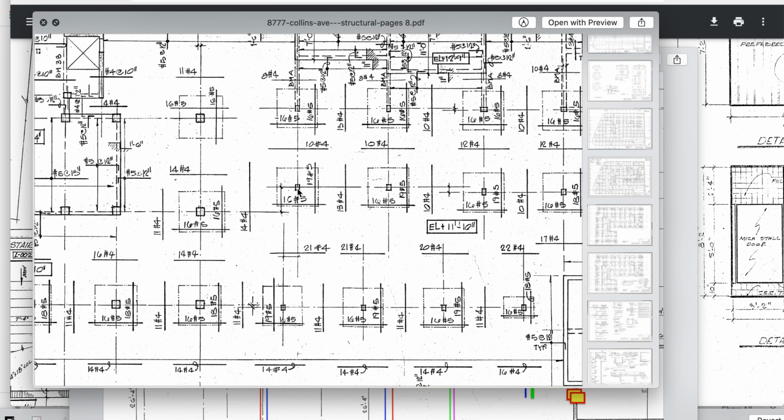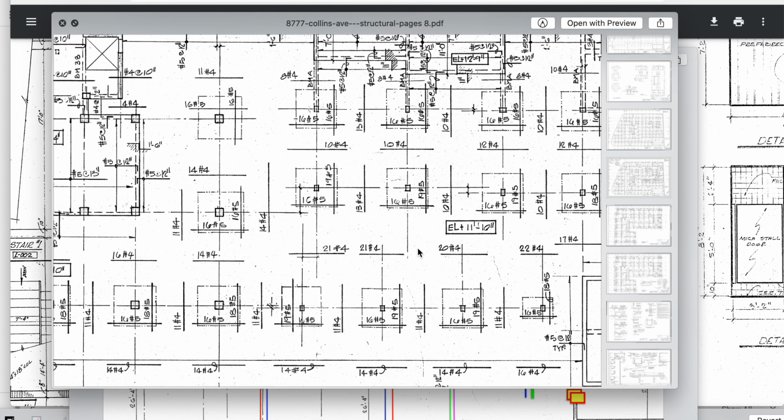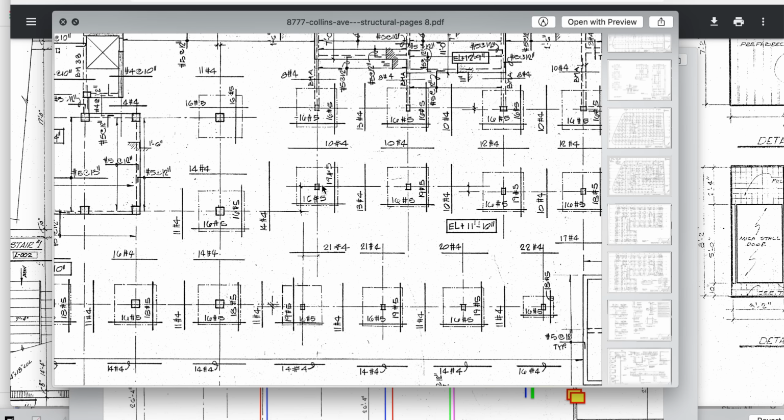So basically you're going to get one piece of steel starting on center, down the center there, because your 13 inches now puts the next piece of steel out here. And 13 inch on center from a 12-inch column puts the other one out there. So you're basically getting one piece of steel that's over top of the head there, along with the rabbit ears, right? So we saw the rabbit ears, the four of them. So by starting on center, you're getting one piece over the head, one piece over the head into the deck.